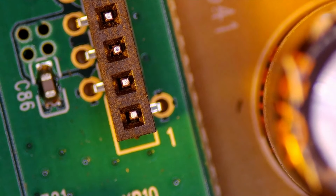Okay, I got my voltmeter there at the top corner just so you guys can follow along. So let's have a look here. We're going to start with these pins. I'm going to hook my ground up to the ground of the board. And again, we're going to test this, make sure we have 26 volts. Put that on the correct setting. We're supposed to be on DC. There we go, 26 volts there, and we should have 26 volts here, which means we should have 26 volts here as well. We do.